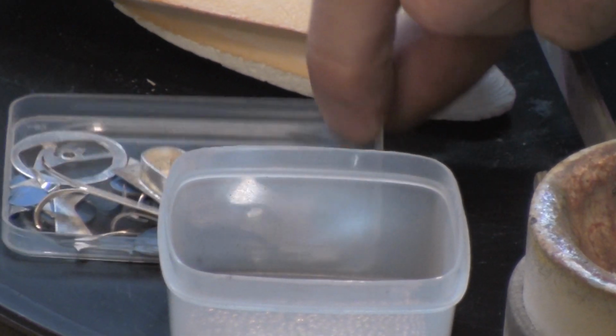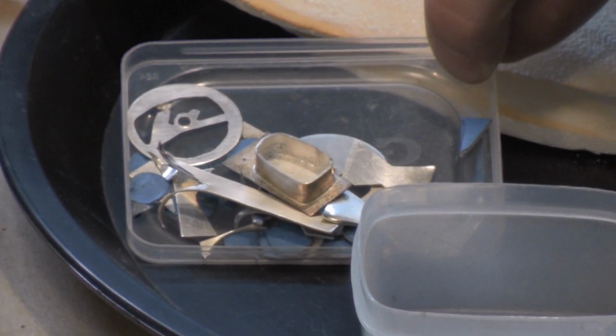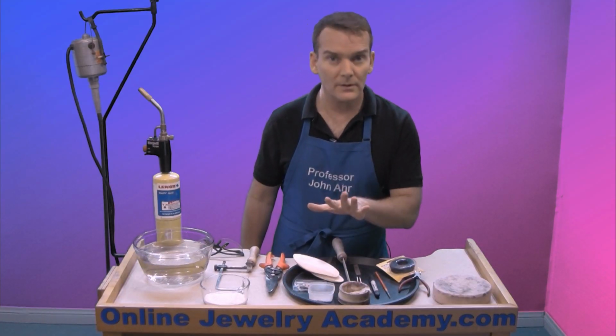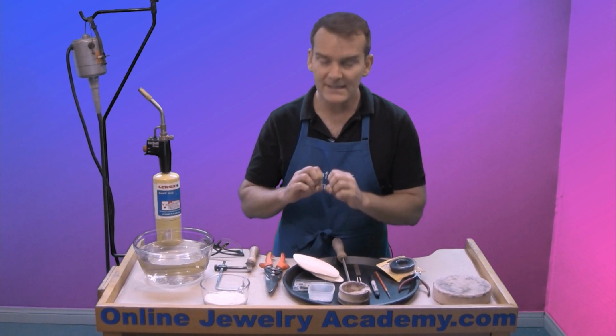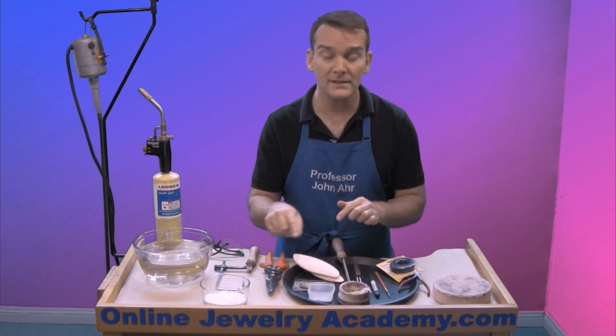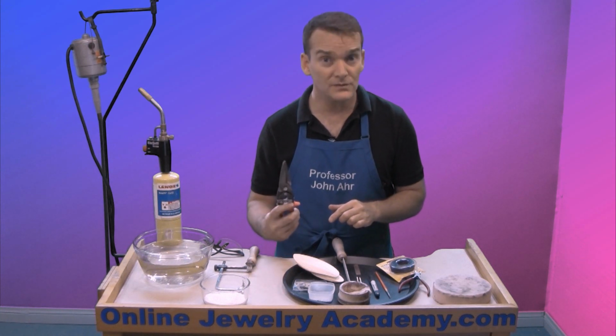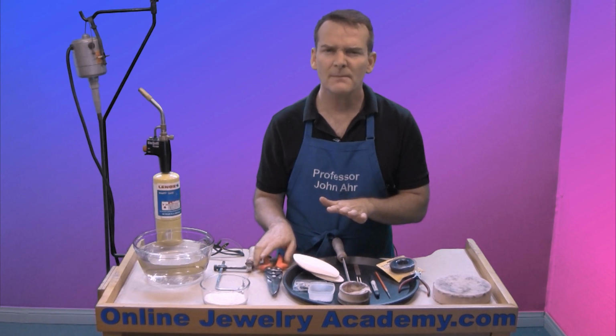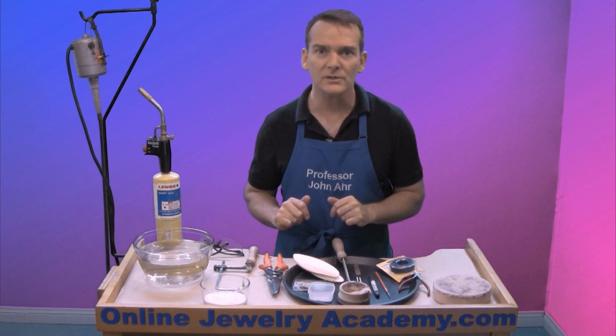And you can combine it with some sterling silver scrap. Now, if you use scrap material, in order to make this melt quickly, you may need to increase the surface area. And the way that you do that is you cut it into smaller pieces using a pair of shears. Okay? If you don't have a good pair of shears, a heavy-duty pair of scissors might actually work.